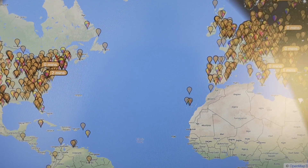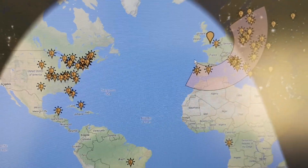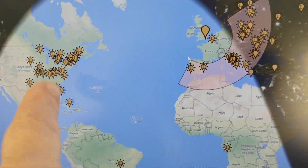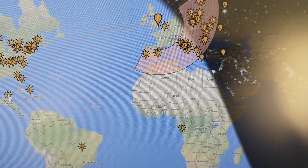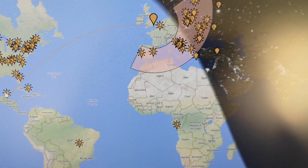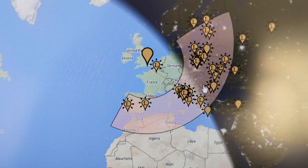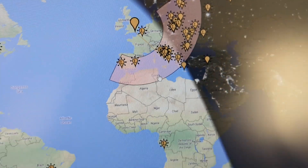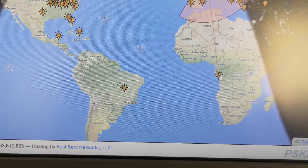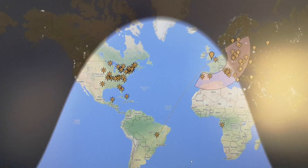Let's look at what's being received now on 15 meters - signals received by me. Zooming out, that signal is being received by the QDX transceiver with that whip antenna on 21 MHz. You can see it's receiving central USA, east coast, Guatemala/Belize, and Cuba - signal-to-noise ratio of minus 13 dB. So the receiver seems quite sensitive. Here in the UK you can see the majority are at the typical skip distance in eastern Europe, Austria, and so on. There's one in Angola at minus 5 dB signal-to-noise ratio - that's really good - and one in Brazil at minus 23 dB.